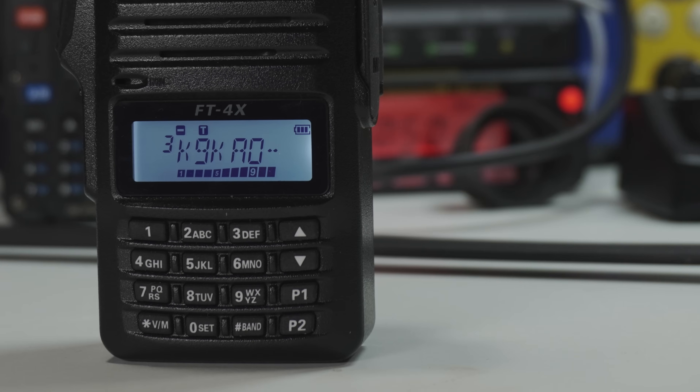I know I like knobs, and that's a pretty good knob. Similar to a Baofeng, on top here there's this little orange button — this is your emergency button. If you hold that down, it does transmit to what's called your home frequency, and you can set that. You can use something like 146.520 as your home frequency, although if you have a tendency to push orange buttons and hold them down, you may want to use something else. There are also P1 and P2 buttons, which are pretty handy. You can use these to set any memory option under the deep menu — hold down the menu button, use the arrow keys to select the menu feature you want, and then program it to P1 or P2. So there's two cool key bindings you can do with the function key — a nice added feature over a Baofeng.